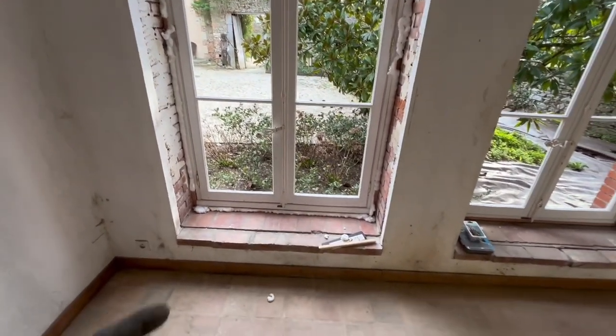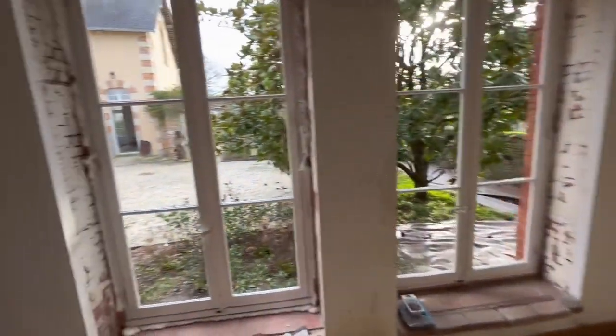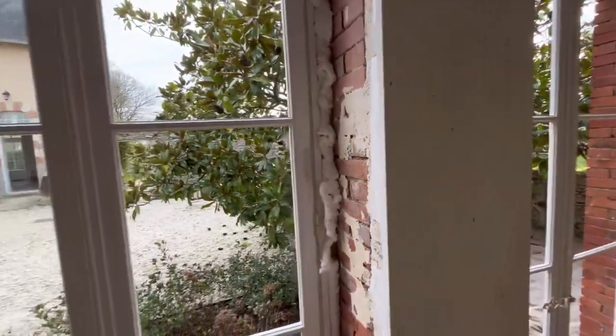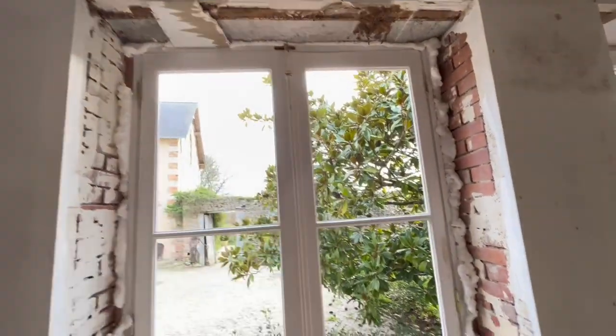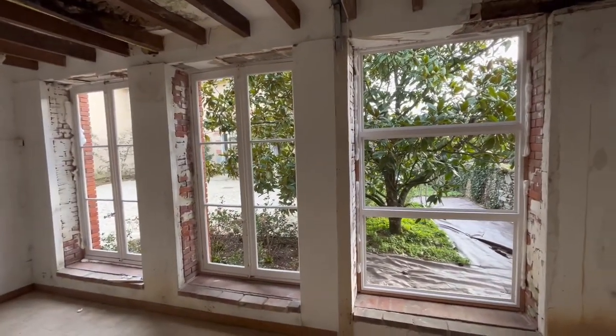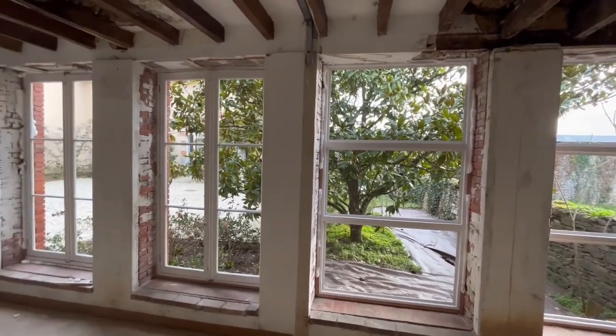So tomorrow, what's ahead? I've just foamed all the windows in. That one, so that one's already been done earlier today. Honestly, I've never used foam that's so expansive. I've barely even sprayed it into that cavity, and already it's just spewing out everywhere. But anyhow, once it's dry, we can just cut that off neatly. Finish that espagnolette. I've just got to finish that one. They're all cut. I've just got to finish off the locking mechanism for them. And the same on that one there. And then these two don't need anything else done. Then it's just glass, which is all there and there. And that's it. So you can do some wet glazing, some more glazing bead on these two, and see how we're looking this time tomorrow night. Hopefully a lot closer to finishing.